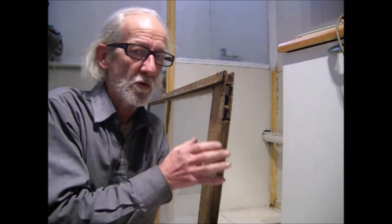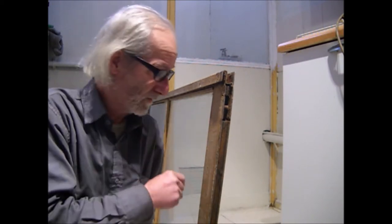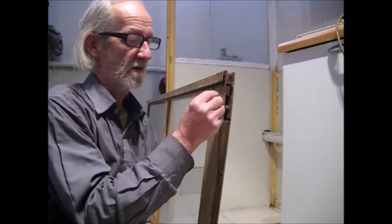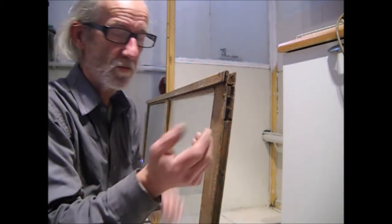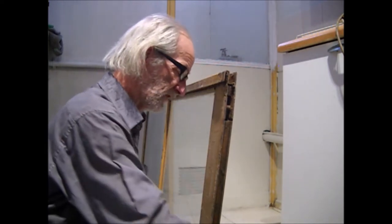So, what some cowboy installers do when they don't find the wheel or aren't up for the job is just to make a hole, to insert a pin like this bolt, making the bolt run along the rail. And that is a crime. The rail was being destroyed, so I searched for the nearest size wheel, and I'll show you how I'm installing them.